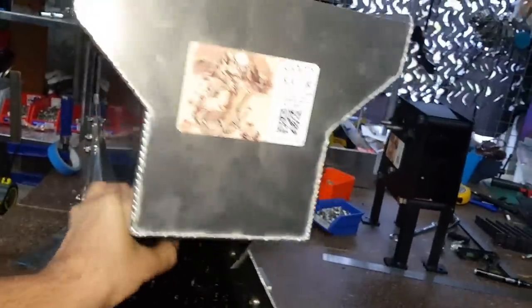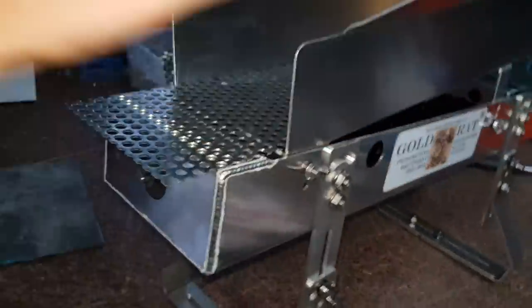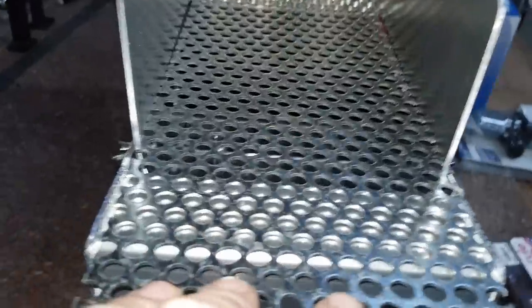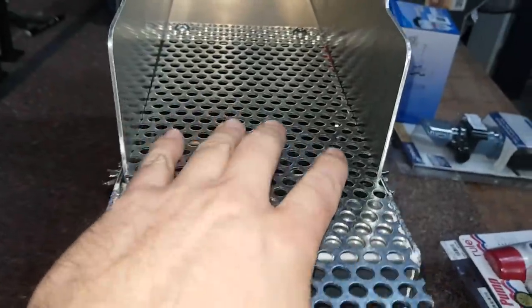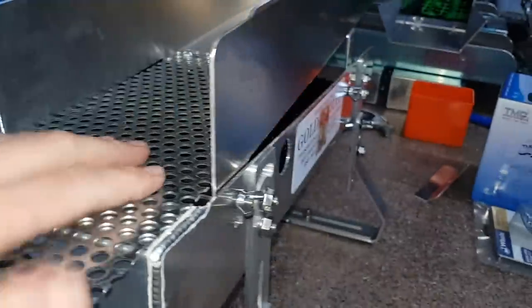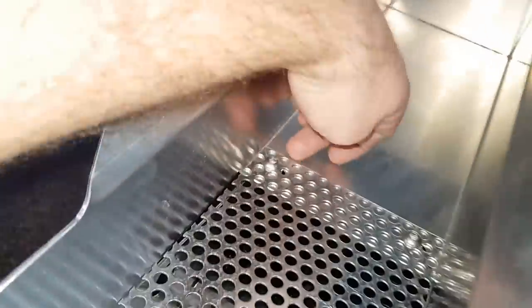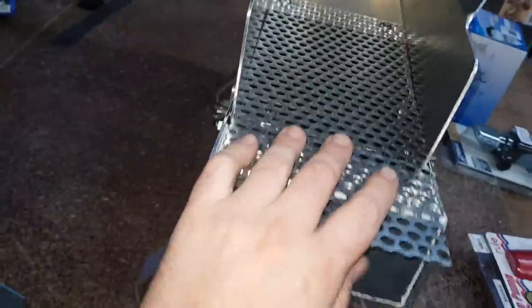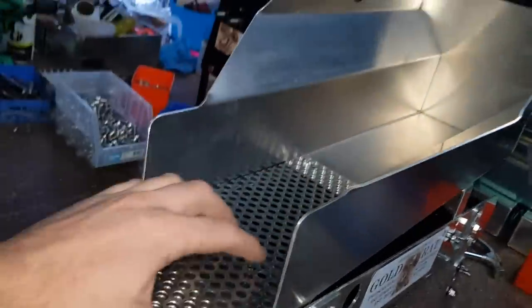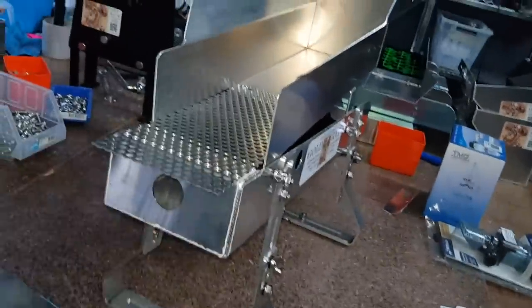We're trying to design as many features in as we can to allow as much customization as possible. We're running a simple perf plate — we love the 8mm offset here, it's 80% open, which is a great option. It's very easy to remove with just these two bolts from underneath. Obviously you're going to get pickers and bits and pieces caught up on here, which is fine — they can hang up in the hopper and don't even make it to the sluice.